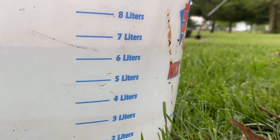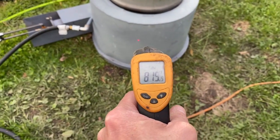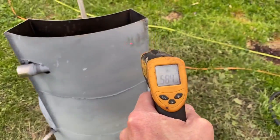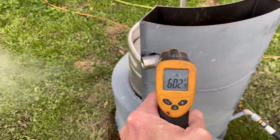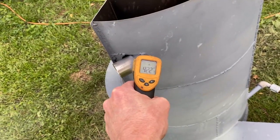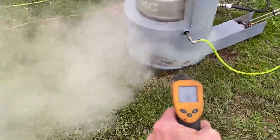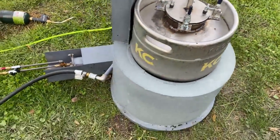It comes to find out we're boiling about a liter a minute, bringing it from boiling to 300 degrees, which is pretty substantial. There was no water spraying out of that exhaust pipe — that is some pure blasting hot steam, and this thing is definitely screaming hot. We can adjust the temperature in several ways, which I'll discuss in a bit. But for the most part, this thing is doing very well.